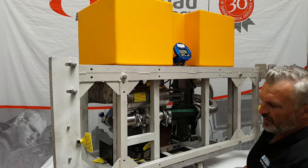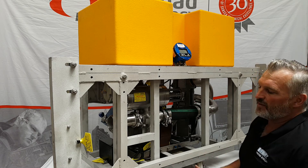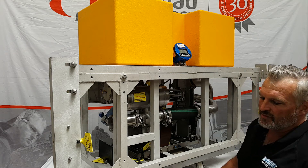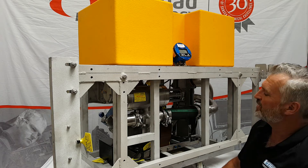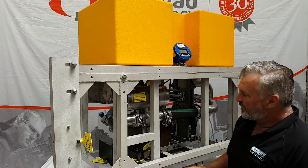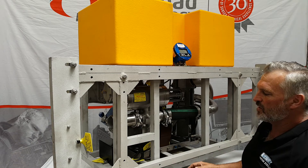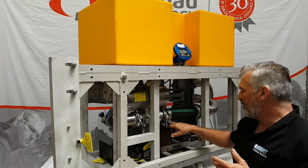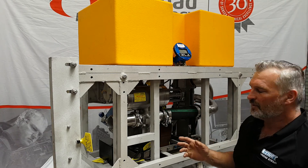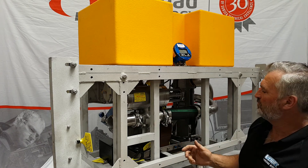What's special about the tool? The big thing that the clients gave us feedback on — they're really happy with the data we gave them, and it sort of set a precedent. So they asked, what else can you do? We're sending them pump RPM so you can see if the pump's working, and you can start to diagnose where things are going wrong if the job's not happening like it should. We can tell them if there's water pressure in both directions. This is all going on the topside computer.